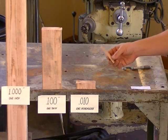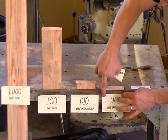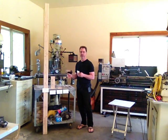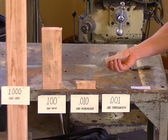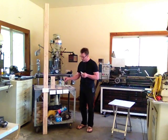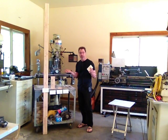The next one here — a thousandth of an inch. This is really what I would say is the holy grail in most machine shops. This is where we try to reach plus or minus a half a thousandth. That's pretty amazing when you look at this thin piece of wood compared to our one-inch model. It's what we try to be within. So if we want to press a shaft into a bearing, we're going to be plus a thousandth of an inch, and that's going to press it right in — matter on the finish of the surface, of course.